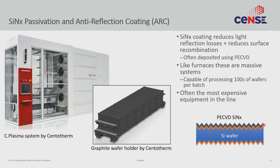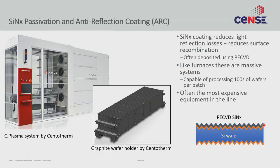In the previous lecture, we had finished PE-CVD. This is what the cross section looks like. You have a silicon wafer, and this orange layer is the doped phosphorus. The doping is on both sides because we were doing this without any patterning, so there is phosphorus on the backside too. This phosphorus will go away later, but for now it is there. On top of the front surface, we have deposited a layer of PE-CVD silicon nitride, shown in dark blue, to reduce reflection of light.